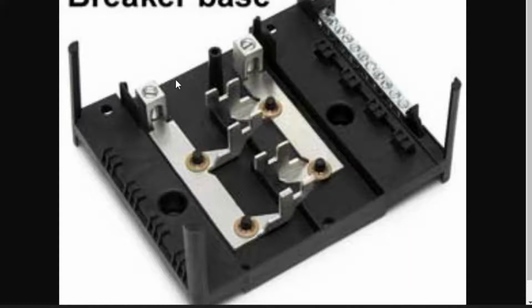So in the US, we actually have 220, 240, whatever you want to call it, because we have 120 from our neutral wire or ground to our side 1, side 2. We don't do phases in the US. We have single phase power at home. But we do have a split phase transformer.